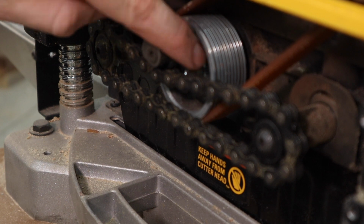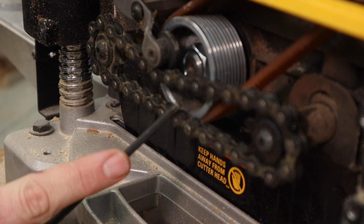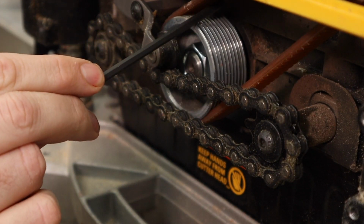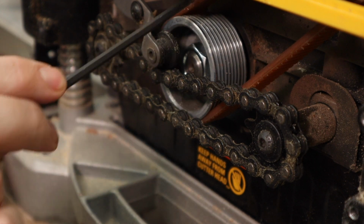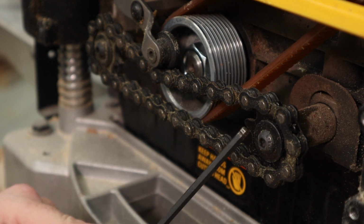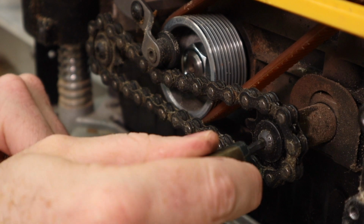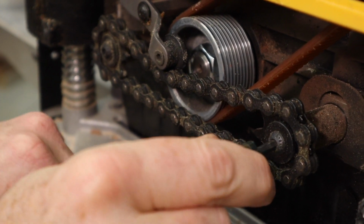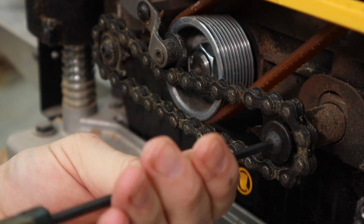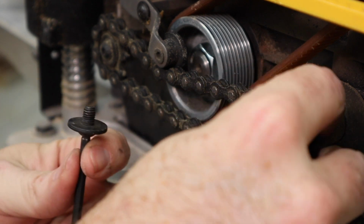With the cover removed, I was able to identify a couple different problems I had. The large nut holding the pulley on was completely missing. The belt had slipped halfway off of the pulley, and one of the drive mechanism's gear had completely fallen off. Luckily, all three of these items were a simple fix. I ordered a replacement nut, tightened down that pulley, readjusted the belt, and put a drop of blue Loctite on that Allen head that holds that gear in place.